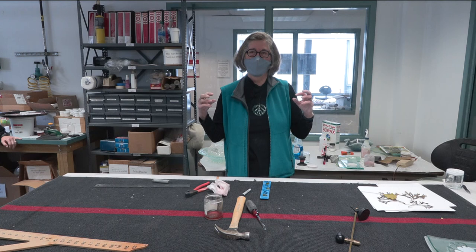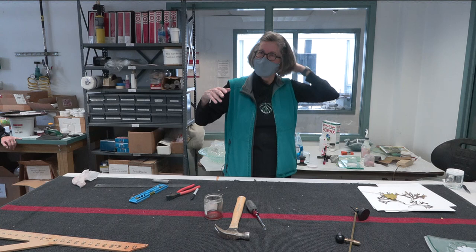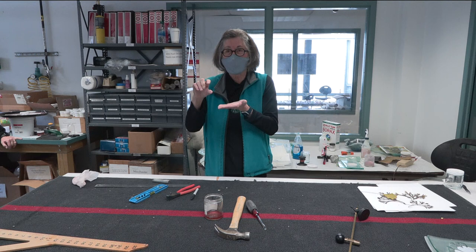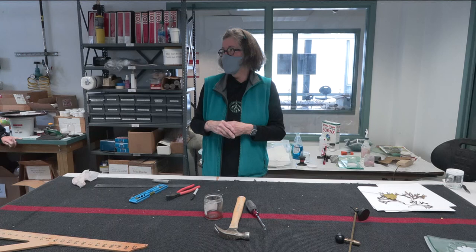For typical tempered glass, after making the glass, it's put back in an oven, and the top and the bottom are both heated and then cooled. When they cool, they contract, the top and the bottom, but the center is still warm. So the center of that piece of glass wants to cool and contract, but it can't because the top and the bottom are now stiff because they're cooled. That creates the tension. There's another way of doing that, and it's called ion exchange.